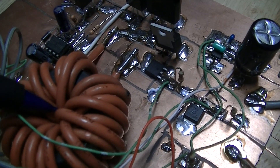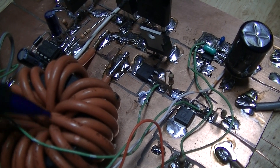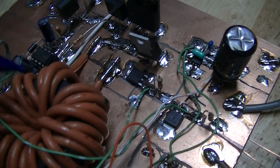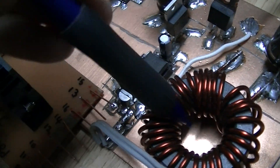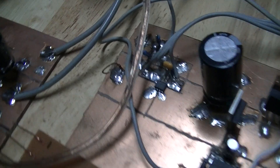I couldn't find any of my 12 gauge magnet wire, so I wound this with just regular multi-standard building wire — THWN, THHN, and MTW; it meets a couple of different wire standards. I was only able to get about 26 turns on it versus the 32 turns on the old one, which is wound with 16 gauge because that's a lower power eval board.